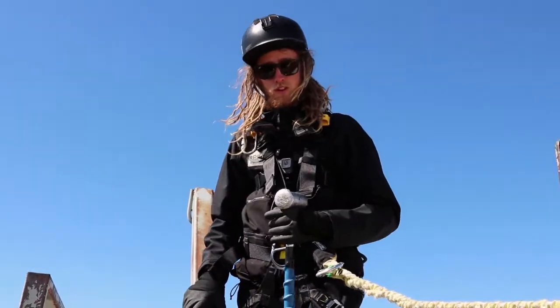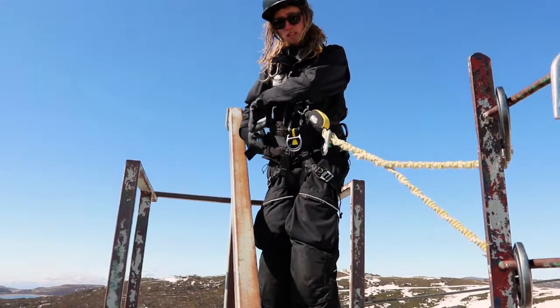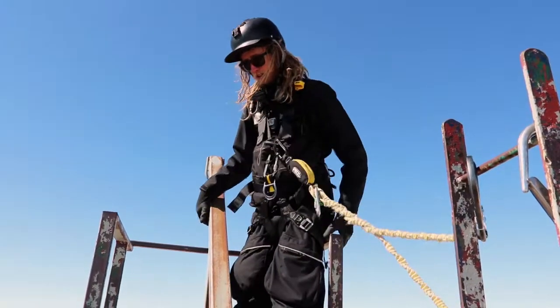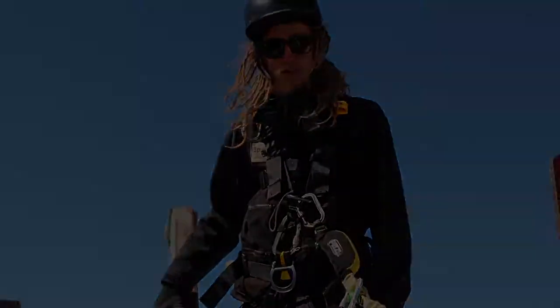Again, when we're calling in for a creep, I'm going to stand well clear away from these sheaves to make sure that they're spinning freely. I'd make sure that my shoelaces and things like that are well and truly out of the way before I call in for that creep.